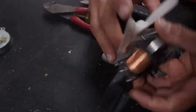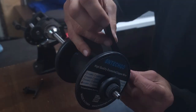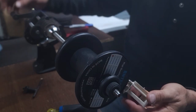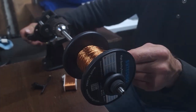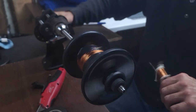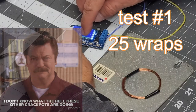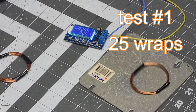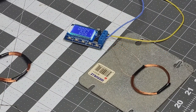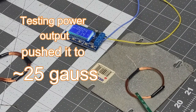Teaching time. This is how a lot of companies fool consumers — they use really small wires. You're going to see why using small wires is not good: it has really high resistance but no tolerance to heat. So they run a lot of current for a very short duty cycle, like 1%, and get a lot of woomph out of it. Now I'm at 6% duty cycle making 25 gauss with this little coil.